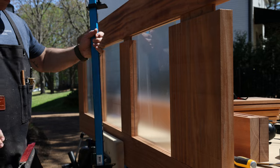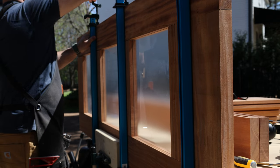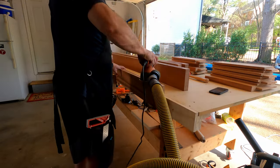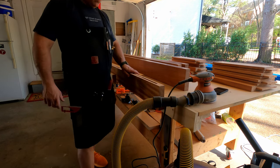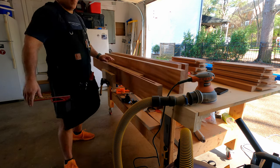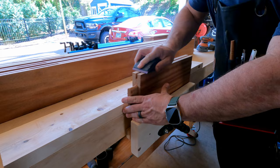These sure-foot aluminum bar clamps were extremely useful in pulling everything together and making everything nice and tight. When we get to the final glue-up, these bar clamps will be key. Now that we've had a successful dry fit, it's time to finish the inside edge of these doors. One of the things I kept thinking about was what's going to be the best way to finish these inside edges without making a big mess on the glass and on the edges themselves. The solution was to finish the inside edge first before doing our final glue-up, so we used the clamp on my table to hold everything and went through the process of doing a nice 220-grit sanding and cleanup before putting on our finish.